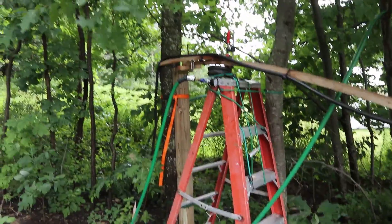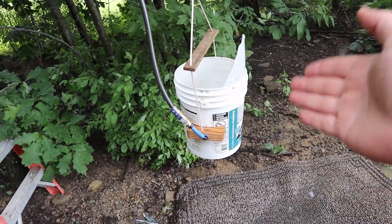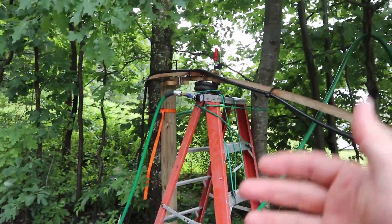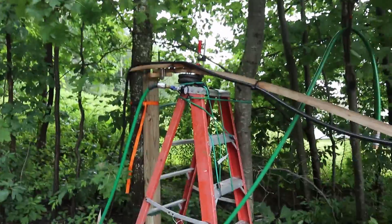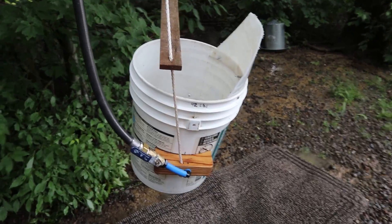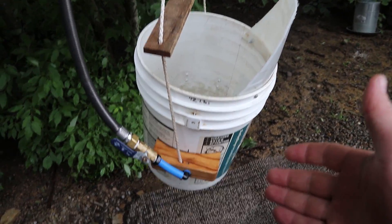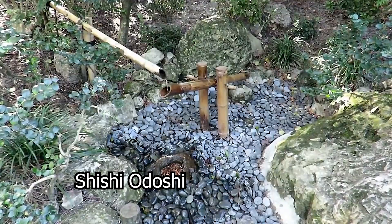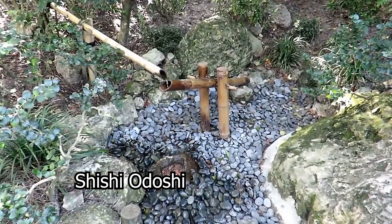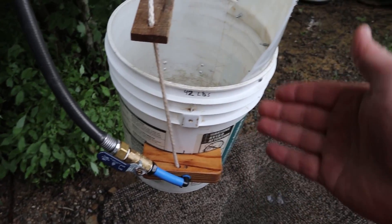I'll be remaking this with a lot stiffer setup, something on the ground with an adjustable bellows mount, and everything should be adjustable. I can even vary the volume of the bucket that's tipping so I can make it consume less water but I'll get less force — so it's faster pumping, you get more volume but lower pressure, because volume and pressure are a trade-off in this sort of thing. The Japanese have been making devices similar to this — they're called a Shishi Odoshi, and every time they bang they keep away animals, so this has a very similar functionality to those.